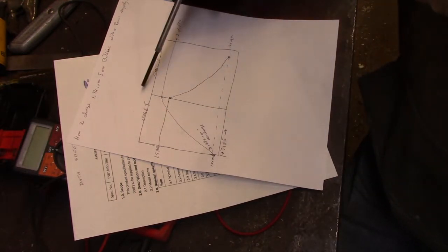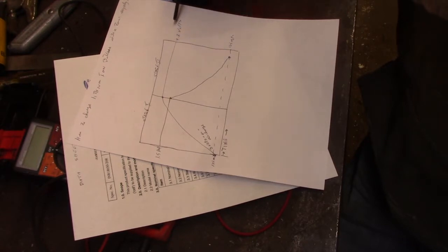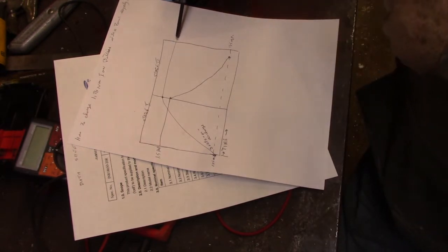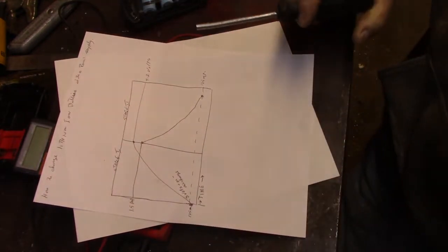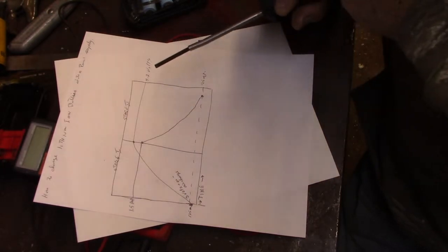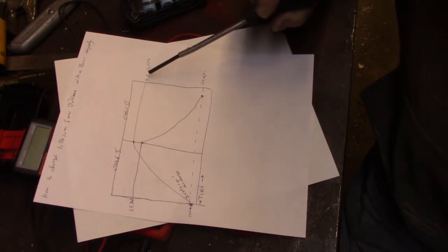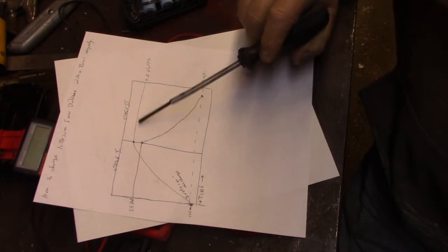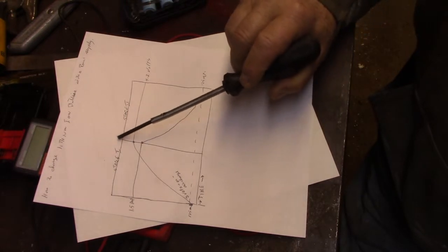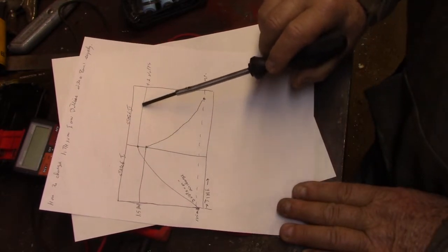And when you reach optimum voltage, which is right here, you'll be at 4.2 volts. That's the maximum voltage that you can put in one of those safely. If you exceed that, like what we were doing, taking a 12 volt battery charger and hooking it up to the batteries, I could have blown that battery up, because that battery charger is 16, 17, 18 volts. So 4.2 volts is the maximum voltage you want to put on the battery. Once you get to the optimum voltage, you've maxed out the amperage, and then it holds at 4.2.